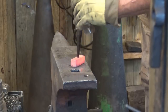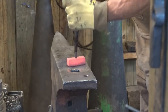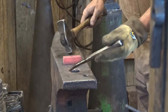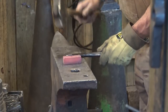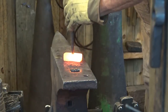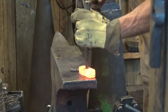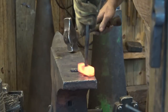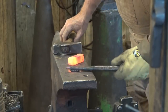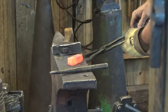I have to straighten this punch out before I'm done - it's bent a little bit. It's been overheated many times in its life, but I've also been using it for about 20 years so it doesn't owe me anything. No idea what the steel is. We have a hole all the way through now. Somebody out there is saying you don't want a round hole for a hammerhead, and that is very true. That's exactly why this punch gets overheated, but it's done a whole lot of these little hammers.